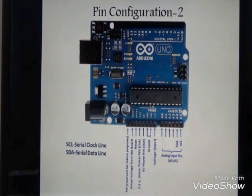After the analog input pins there is a group of power pins. The first is VIN — voltage input pin — then 5V power output, then 3.3V with a maximum current of 50 mA, then a reset pin, and a pin reserved for future purpose.